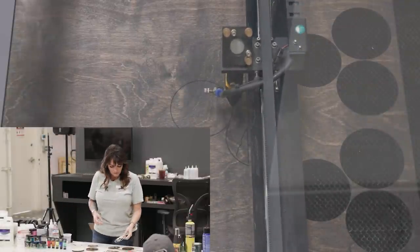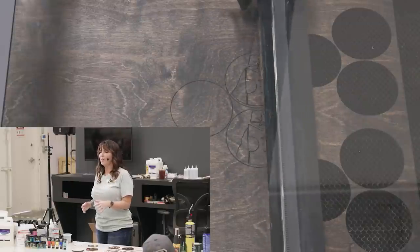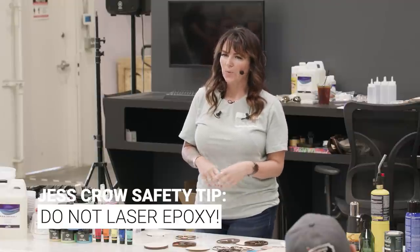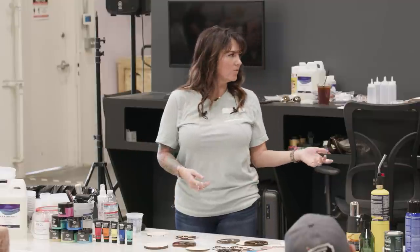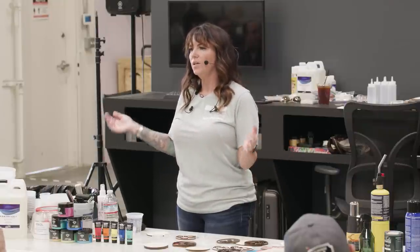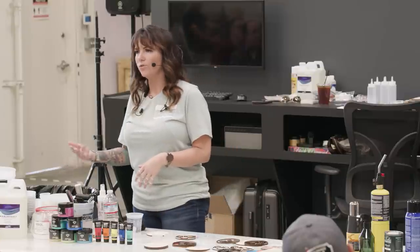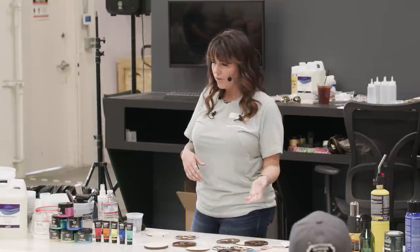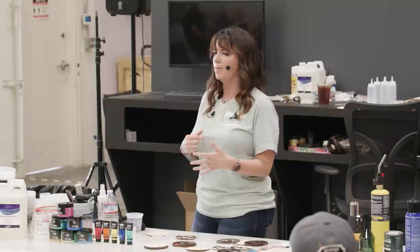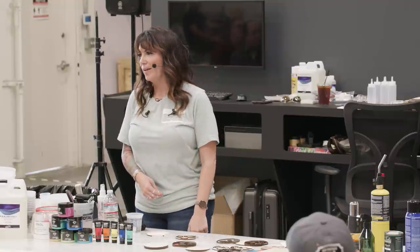Here's another important thing I almost forgot — you cannot laser epoxy. I was so disappointed when I found out it might kill you. I've been working on a workaround, but apparently it only involves a super enclosed special unit. All epoxy to date is poisonous when you laser it — even though the epoxies we're using are food safe and no-VOC, there's some sort of chemical reaction that happens between a laser beam and epoxy. Please don't do it.